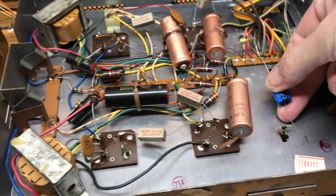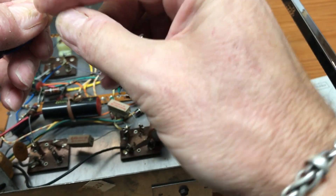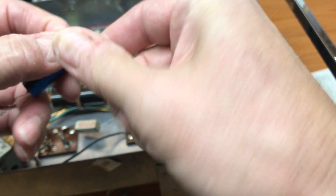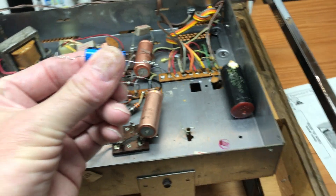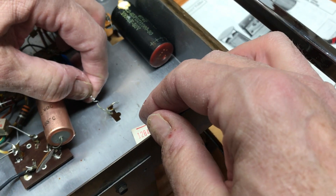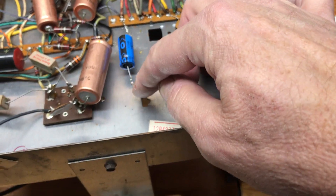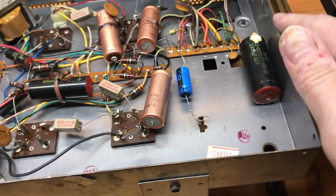What I like to do is measure it up to make sure it's going to fit, then make these nice little coils using a small jewel screwdriver. Sometimes you're going to cut them to fit — sometimes they're too long, sometimes too short — but generally you have enough room. And there you have some nice little spirals on those connector ends. You pop it on there like that, and then you hot-solder all along that little joint, and it's going to fill in all the little coils and make a nice connection. I haven't gone wrong once — that's the way I do it.